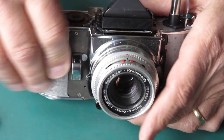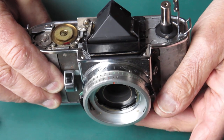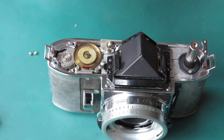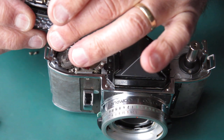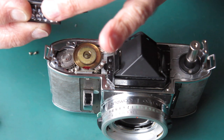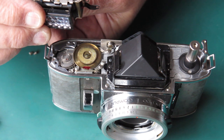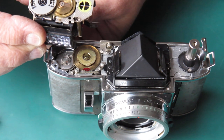So I'll need to set the camera. I'll remove the lens, because this only goes to f2.8. With this set to B and f1.9, I should be able to lift my meter into place, set to ASA 10, and I know roughly where the alignment should be. I've got my meter here. Let's get that round at ASA 10. About there is the correct alignment.